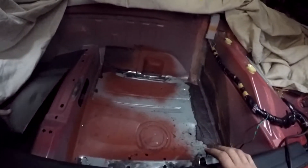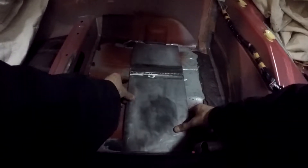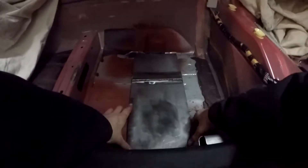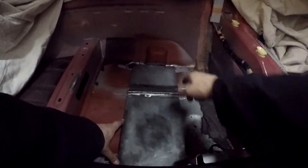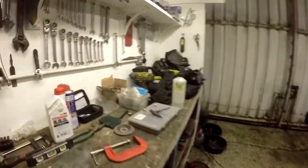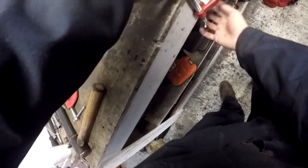This bottom back corner here is causing me a little bit of grief — this side's level over here and this side is a bit not. That's my technical diagnosis. It's about a finger's worth. What I'm going to do is tack there, tack here, tack there, and tack there. And what I'm going to put underneath that far right corner is I'm going to create some shims.